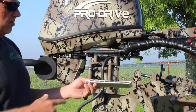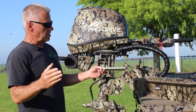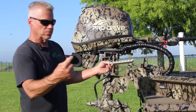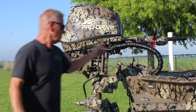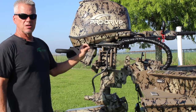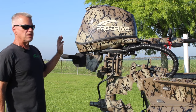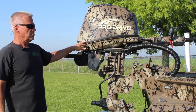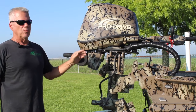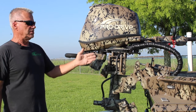We're going to have coolant in here for up north. Jet skis also actually have a little pad, a little keel cool on the bottom of them, and that's how they're cooled. So it goes in and there's a pump. The pump is thermostat regulated. The manufacturer likes this engine to run around 165 degrees. So that pump, as it's running, won't activate until it's at least that temperature, and it'll regulate itself throughout the day.